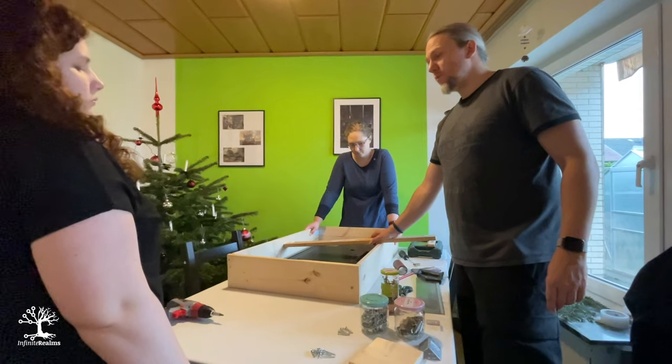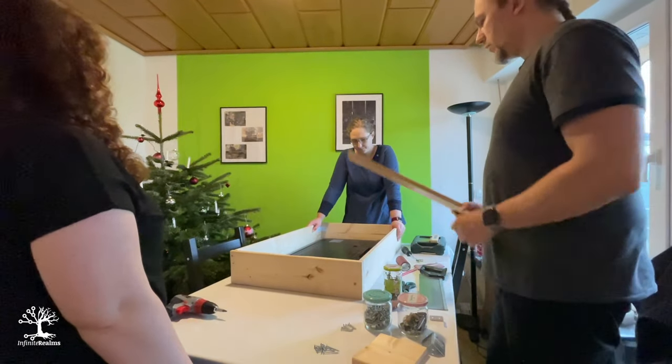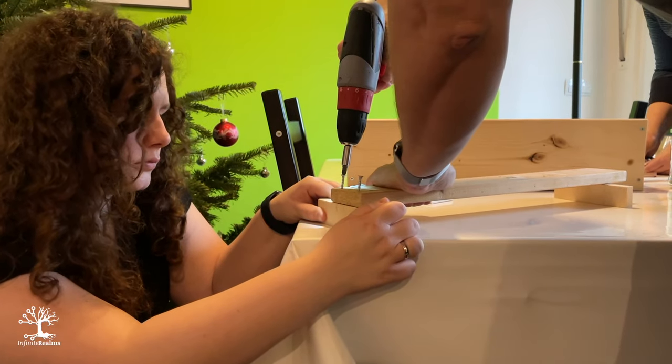At the ends with pre-drilled screws and on the inside additionally with metal angles for reinforcement. Then we put the TV with the screen on the table and put the assembled frame over it. In the next step, we thought about the best way to support the TV on the back. It should lie flush in the frame on the upper side so that we still have the option of mounting a sheet of plexiglass over it later for protection. Since the TV is pretty bumpy on the back, the support mutated into the most complex part of the case within the next hour.